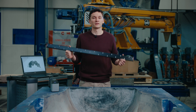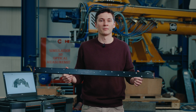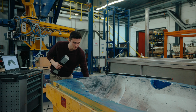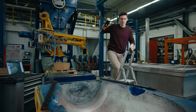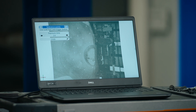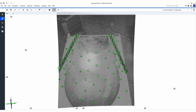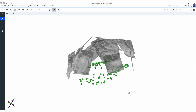When using satellite mode, we use our 6mm uncoated markers as well as our certified hyperscales. These help to greatly enhance the volumetric accuracy for large parts compared to class-scale built-in photogrammetry. During our measurement, we take single shots from all around the parts, creating an umbrella shape that you might know from the built-in photogrammetry of the T-ScanHawk or any external photogrammetry. Our red laser grid indicates the field of view of the scanner and helps drastically when aiming with the system. Last but not least is the inspection software that is able to identify all reference points and the exact relationship between these reference points on a large scale.